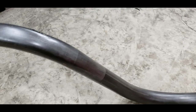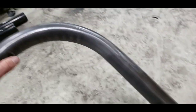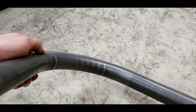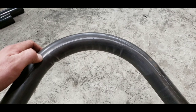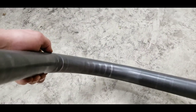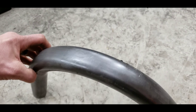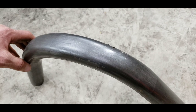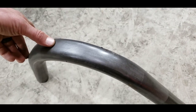These are my first couple bends with the bender when I first got it set up. This was my first bend having the second roller in. It snake-bellied — as I like to call it — there in the middle you can see some pretty bad wrinkle and some markings left on it. You definitely don't want to have that second roller in there if you're trying to bend thin wall tubing. Anything under .120 wall is considered thin wall at the inch and three quarter size for the Rogue Bender.